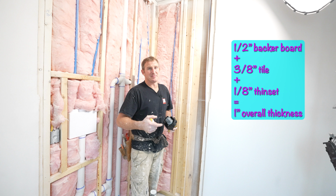Okay, so in this shower we're going to be installing a single mixing valve, and then we're going to be using what I really love and I think is a really easy installation, the Kohler Hydro Rail. So basically we're just going to be installing one valve with a single shower port, and then everything connects onto that after the tile is installed. So it really reduces the expense because you're just having a mixing valve. You're not getting a separate diverter valve. That'll all be incorporated with the Hydro Rail system.